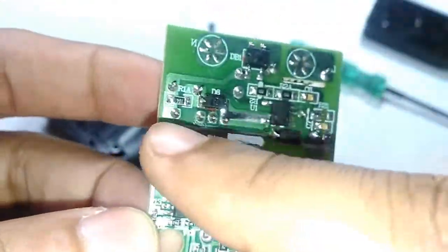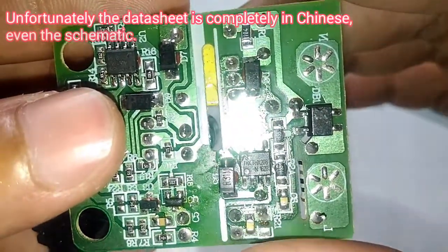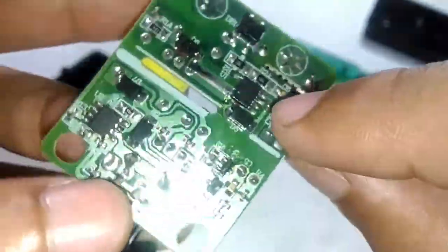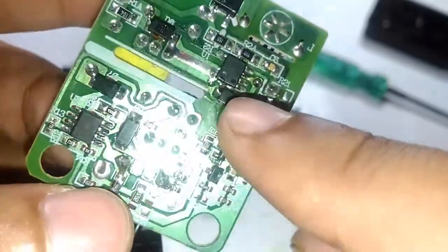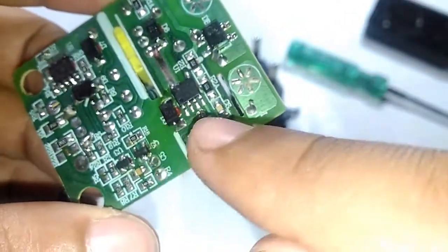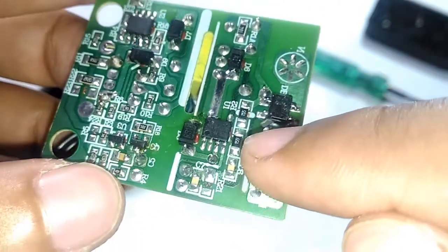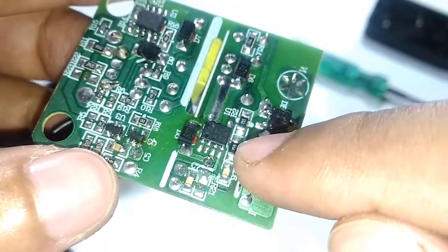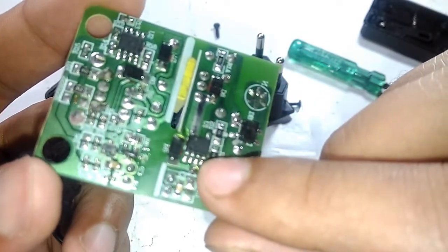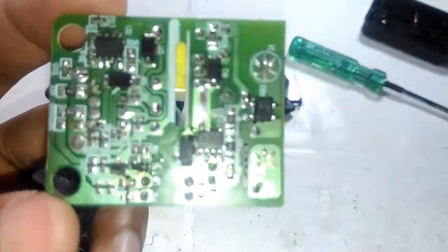And this right here is the all-in-one chip. It's a THX208, the one chip that does everything. And this diode has to be the rectifier power supply for this chip, because it is connected to this capacitor also. And this high value is a 155, so two of them in series make 3 megaohms. So that has to be the initial power supply for this chip.